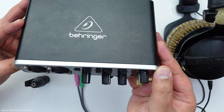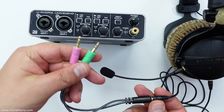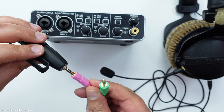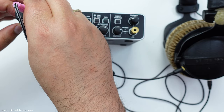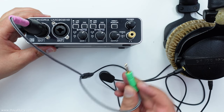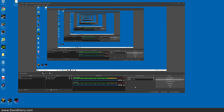What you're looking at right now is my Behringer audio interface. As you can see here, I'm using the same TRRS to mic and headphone splitter. But this time the microphone is being plugged into the Rode VXLR+. The reason for that is because the Behringer sends out 48 volts; the VXLR+ drops that down to around 6-7 volts, which then powers the microphone. Because this microphone is a condenser type — or to be exact, it's an electret or back-electret. And then obviously the headphone is just plugged into the headphone socket on the Behringer.